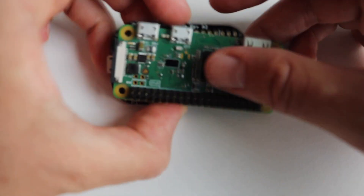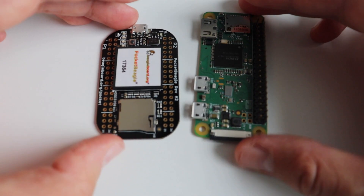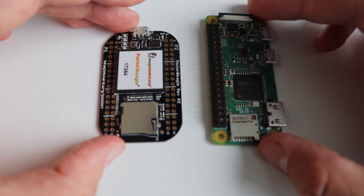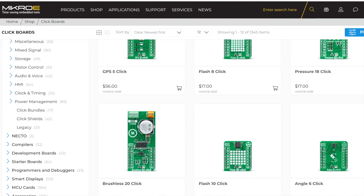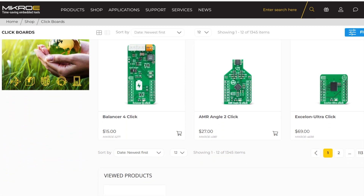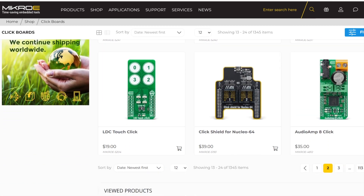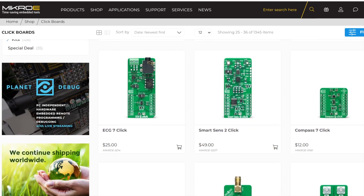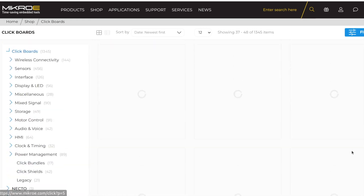Also Raspberry Pi Zero W and Raspberry Pi Zero 2 feature Wi-Fi and Bluetooth connectivity. However Pocket Beagle also has some advantages compared to Raspberry Pi. Unlike Raspberry Pi, Pocket Beagle offers 8 analog inputs and it has significantly more digital GPIOs — 44 of them. Another nice feature not present on Raspberry Pi is the MikroBUS socket connection, which allows you to easily attach MikroBUS click boards, a trademark of MikroElektronika, who manufacture a significant number of these click boards.